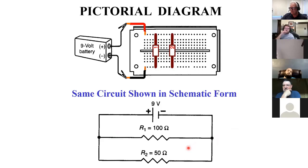Okay. So here's what I'm going to say. In theory, it's true, but if you put a no resistance, you're saying a solid wire, if I jumper this out, I'm going to divide 9 by 0. Mathematically, you're not allowed to do that, but the number approaches infinity. When you have a number that high, if there's anything flowing here at all, it's so minimal that you can discount it, because you might as well say that it's all going this way, because almost infinity is going this way, but not quite. But you're not going to be able to measure this. What's going to happen if you did that is this is going to blow up. Right. You don't have a protective device. There's no fuse in here. When you have current that's going up towards infinity, this thing's going to heat up so much. There's going to be some bad stuff happen. I don't know how it's going to show up, but it would.